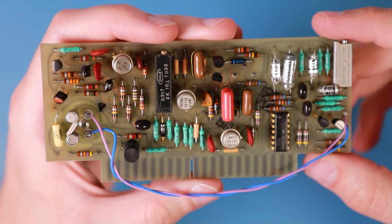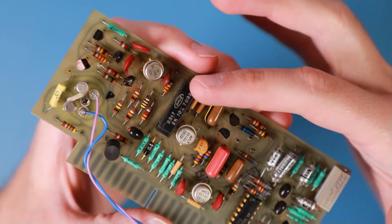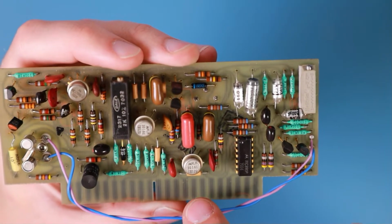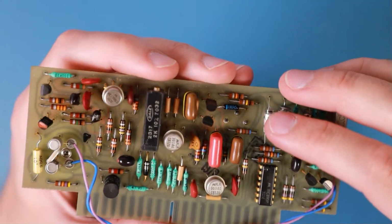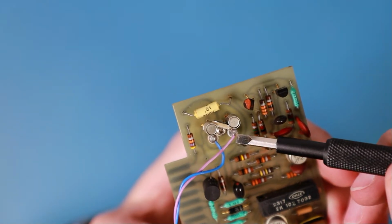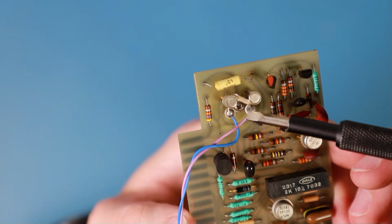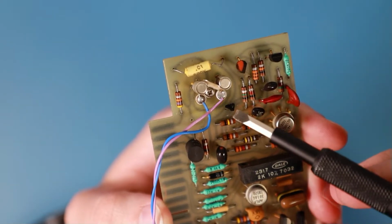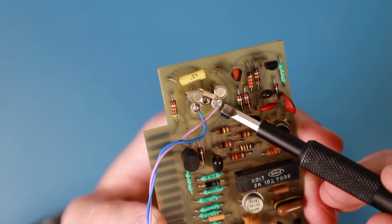So this seems to be some kind of analog stuff. There's a trimmer pot on there. There's a special cable which brings signals from here to here or vice versa. And again, here's this strange construction of small metal pieces where you can solder your wires or components on, that are insulated with, I think, a Teflon sleeve and put through the PCB.